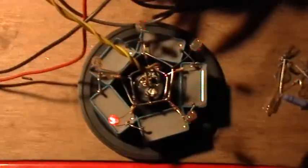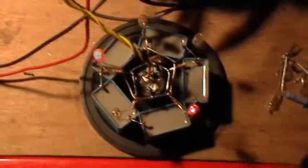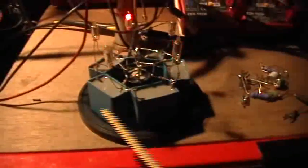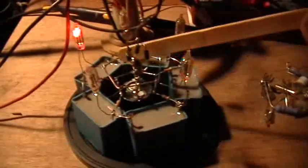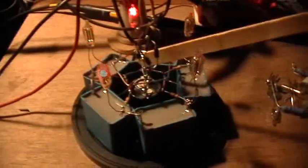Good evening, welcome to my laboratory. That is a ring oscillator — an NE2 ring oscillator. These are one microfarad capacitors; in the middle there is a 220 microfarad 200-volt capacitor. These are 220K resistors, and that's a full wave bridge made out of 1N4002 diodes. And of course these are NE2s.